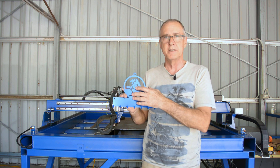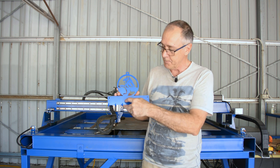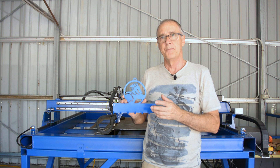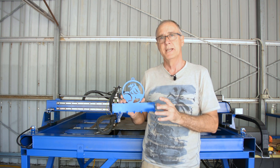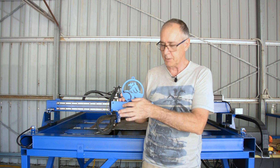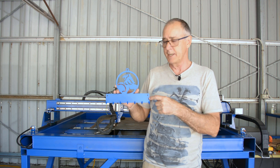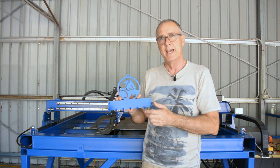They want theirs in black — it matches his black Commodore — and we just got his name cut in here as well as a personal touch. I'll show you what that design looked like; we did it in Inkscape, fairly easy process. I've got the basis of that whole template and we can change different things — the top emblem, anything else — and of course we can make it bigger or smaller. This is the seven-key model, 245 millimeters wide and 219 tall before I bend the fingers up.